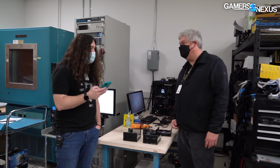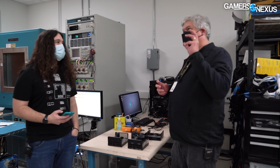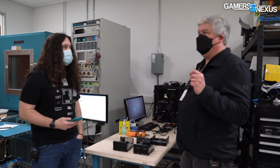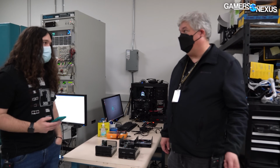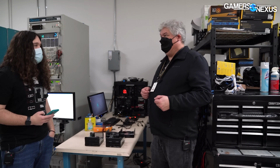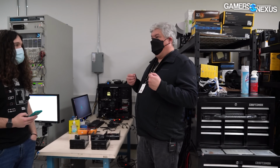I want to ask this: tier lists. How do you feel about them? You know what I'm talking about, right? They've gotten better because they're actually using review data. It used to be people would just grab a brand and say, this one's always tier 1, these guys always make the best stuff. But now they're looking at things like the topology. Is it double forward? Is it LLC on the primary side? They're looking at the secondary. Is it group regulated? Does it use DC to DC? So they're taking in a lot more of the technical information than before.